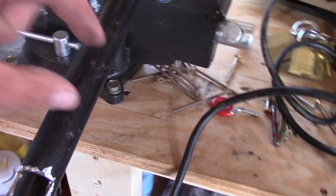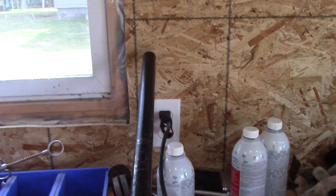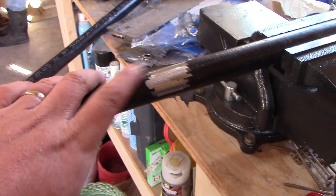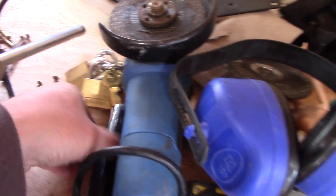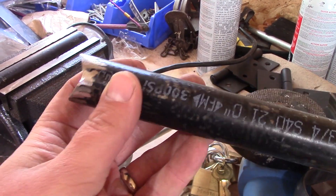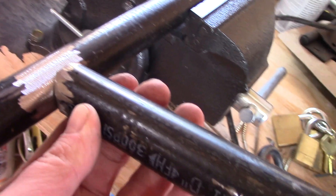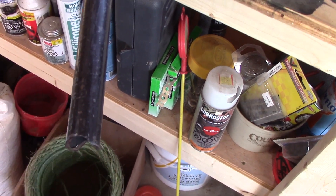Now I'm going to weld on a little foot pedal and the top tee. I got the tee handle here for the top — I just ground the paint off so it will weld better. This is going to be the little foot peg; I've ground out a half moon so it fits better around the pipe. I did that with the main shaft too, and that's where the top tee handle is going to go. Now we're going to start welding it up.